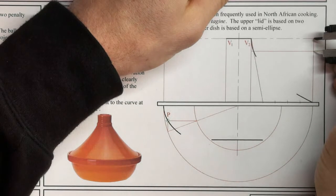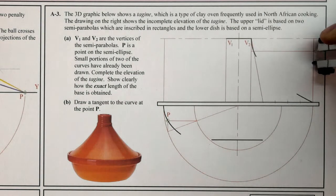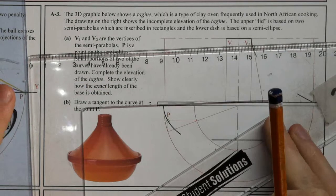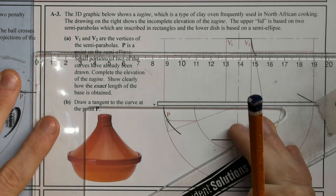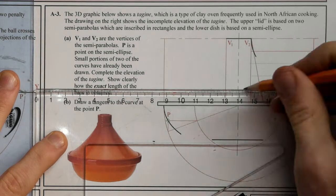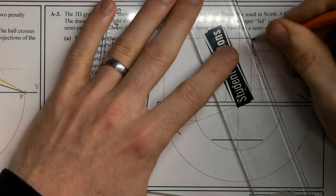And we'll repeat the same thing here for the points running away from the axis along the base of our parabola. And yeah, that matches up perfectly. So what I'm going to do next is draw my lines parallel to my axis. So parallel to my axis there. Okay, and then my lines running up to my vertex. That's a point there.